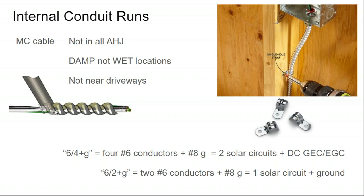You could think that the metal has to do with grounding. If there's a short, it grounds out to the metal, which is attached to the grounding system, and that connects to the ground, and so it gets the ground fault current out of the home as quickly and safely as possible. That's not why DC wiring has to be in metal. You can get confused. There's all sorts of questions like, when does metal conduit constitute a ground path or when does it not? That's not what's going on here. The metal for DC cabling is simply for additional protection.